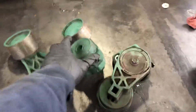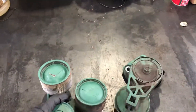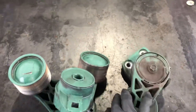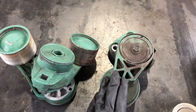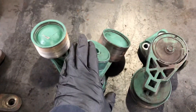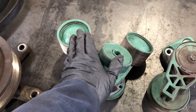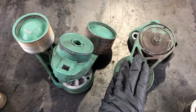Next we have Volvos. For those of you who have Volvos — these tensioners, you have to replace all of them at the same time. Do not change just the accessory tensioner and leave the fan tensioners. Change them all at the same time, that's better. Because if you have to take out the accessory tensioner, you have to remove the fan belt in order to remove the tensioner belt anyway.